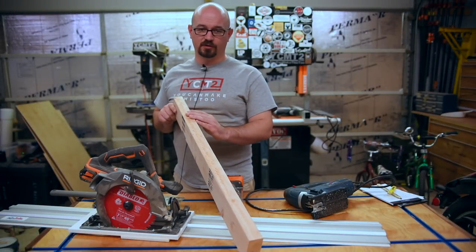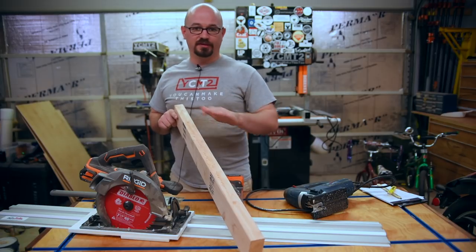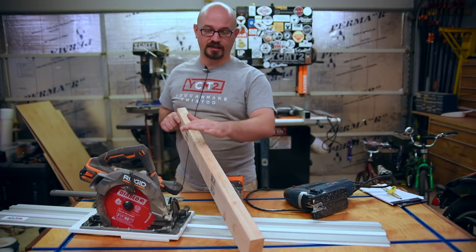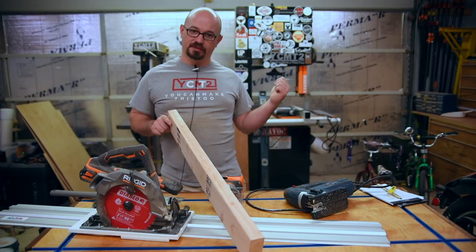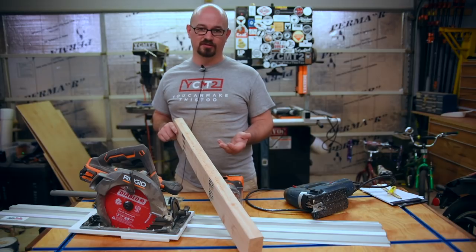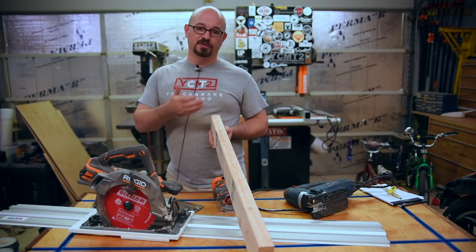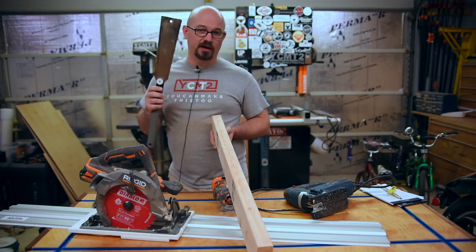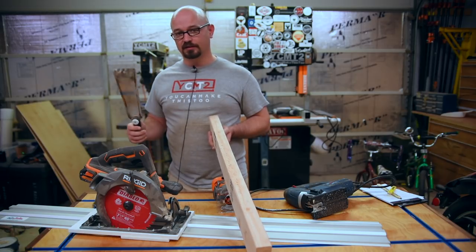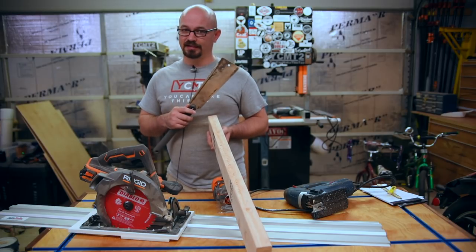The last cut on dimensional lumber was re-sawing — cutting along the grain in the narrowest dimension. I don't recommend doing that with a jigsaw or circular saw, because there's not enough reference surface to safely ride along and give you a good cut. That's really what the band saw is for. You could try it with a reciprocating saw, but it's made more for demolition work, not accuracy. If you're not going to invest in a table saw or band saw and you need to do some re-sawing, just spend $10 or $15 on a hand saw. For longer re-sawing, I'll link below to frame saws, which are made for re-sawing and do it much more efficiently.